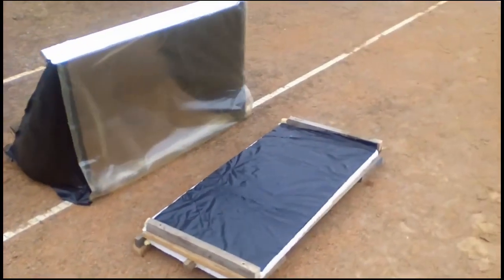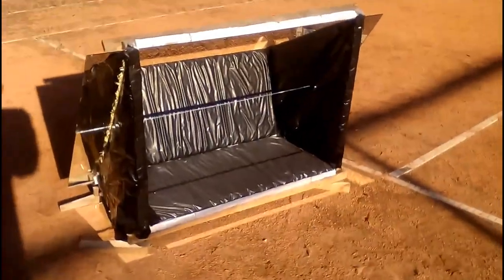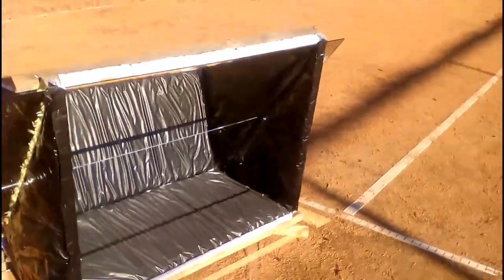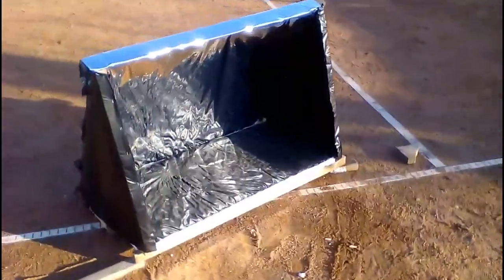Or we refuse to operate our solar heaters in summer and in other periods when the ambient temperature is greater than 10 or 20 degrees Celsius, or we can remove these parts in spring, and the heater is operated in a similar way until the autumn cold or frost. We have to pay attention that the surface of the reflective film is not perfectly smooth, and this is a second cause of that failure, because the reflected solar radiation forms concentrated spots which heat the black polymer to high temperatures and melt it. That is why my solar heater with the glass mirror can heat the water to 80 degrees Celsius when the ambient temperature was 11 degrees, and after this experiment the black sleeve had no damage.